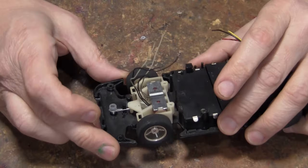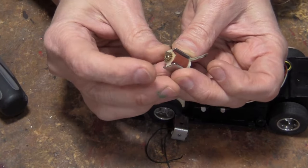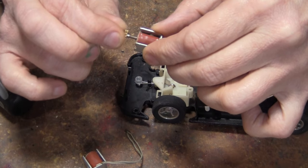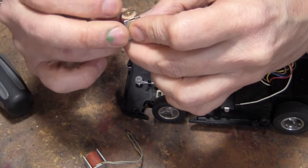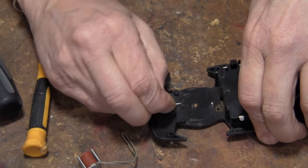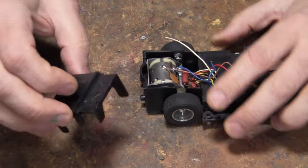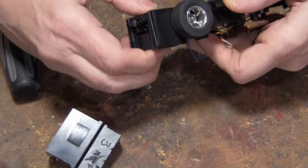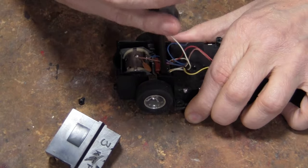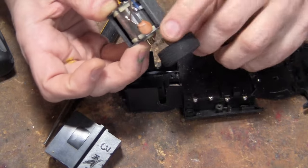Oh yeah, all metal gears inside. These are the little solenoids. This is a coil of wire, so you charge it up and this will slow down. It'll be harder. It'll actually want to pull it back in. And then you let up on it and it'll spin a lot easier. Yep, there it is. Little spring held on here. Pretty sure that didn't do that. That came off. I don't know what that little screw just did. The switch in here, which I see a big giant resistor. Yep. Wow, it's got a metal casing, metal gears, except for this big one here.